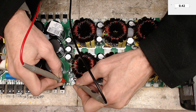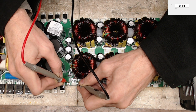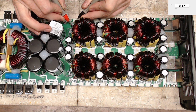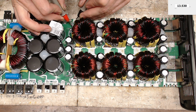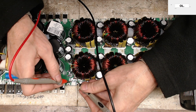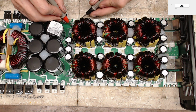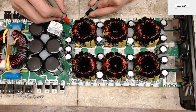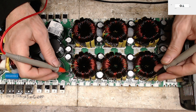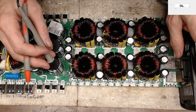Unfortunately, my drive IC is dead. No, 0.44. That's not very nice. 0.44. Oh, is it though? Hold on. Oh, what am I thinking? I'm on the other side of the gate. Oh, that's perfect. Okay. 0.44. But to ground, 1K. Nope. To ground, I am still shorted. 0.4. Where am I shorted at? Drive.